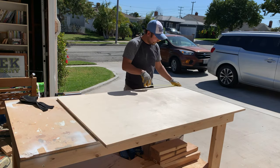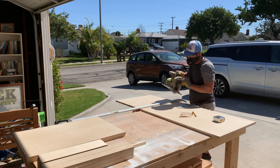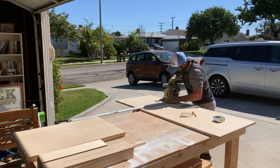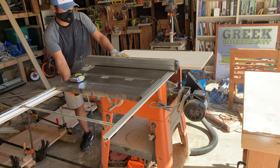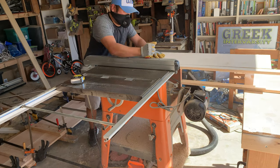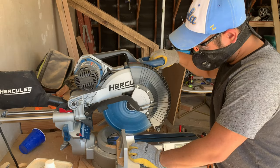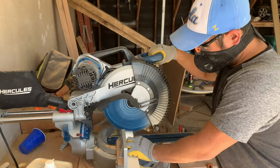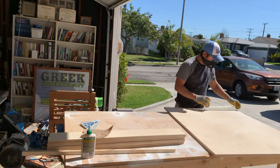The entire base was going to be built from three-quarter inch birch plywood, so here I'm just laying out my cut lines, getting a straight edge guide, and making the plywood more manageable by cutting it down to size. For my table I was going for a U-shaped design for the legs, so I needed to cut a bunch of two-inch strips from the three-quarter inch plywood and bring them over to my miter saw to cut them to the right height. I set those cuts aside and started to make the measurements for the center shelf.